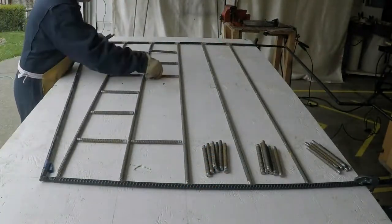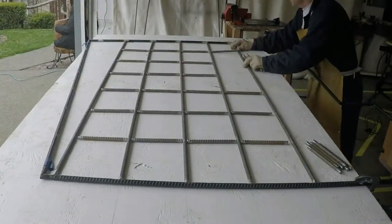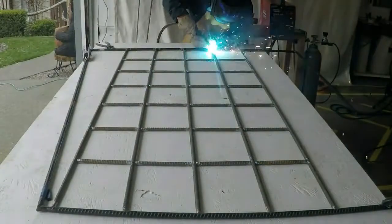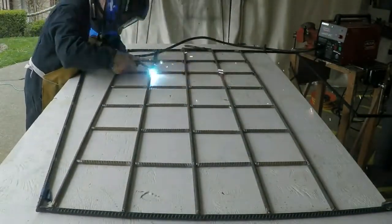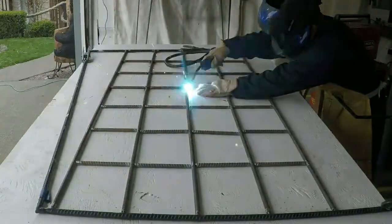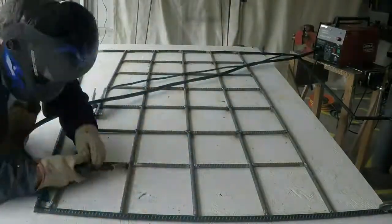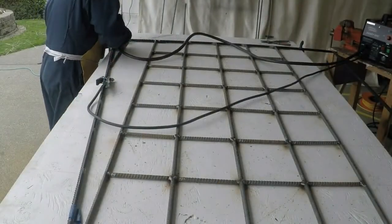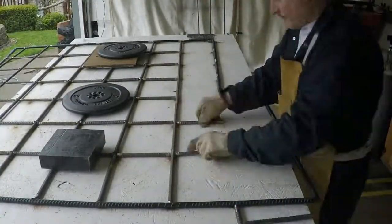You're now ready to place the short pieces of rebar onto your template. You can see because of the prep work you did earlier, every place you're going to weld is clean. For this project, I'm using a MIG welder. Every single place where rebar meets each other has to be welded. Since there is an awful lot of welding to do, I used up a lot of consumables — an entire tank of argon as well as a two-pound spool of number 30 wire. Now that all of the easy welding is done, you need to go back and custom-make each of the pieces of rebar that attach to your frame. Remember, your frame is not square, so each piece will be a different length. When you're finished with the top of the trellis, slide the whole thing up and continue building on the bottom.